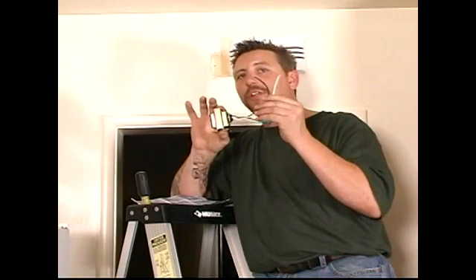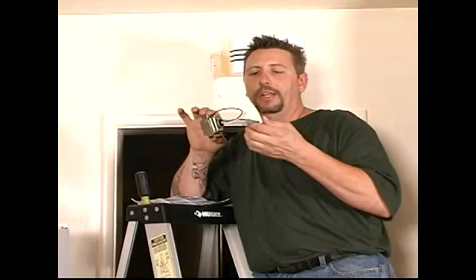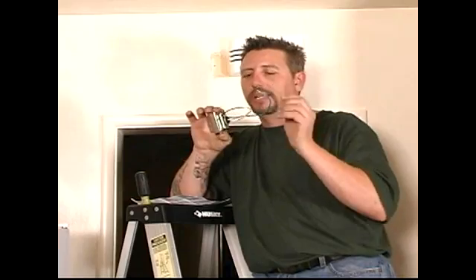You'll have the power off, so you can take those apart, take out the old transformer, and put the new one in its place. All you do is take the black to the black and the white to the white. The green wire — depending on whether you have a newer or older home — is basically a ground. Older homes don't have ground, so you'd tag it to the box it's mounted in or just cap it off. In newer homes there will be a ground, so go ahead and hook that up too.